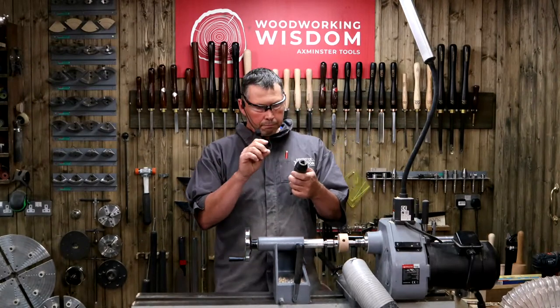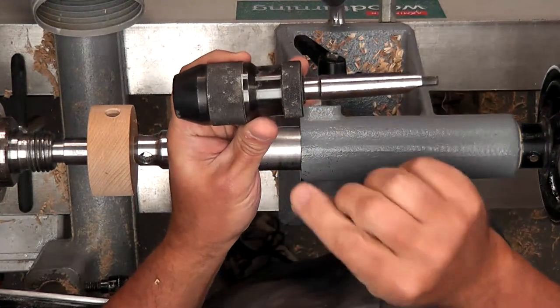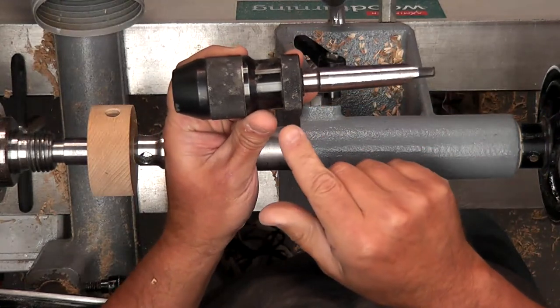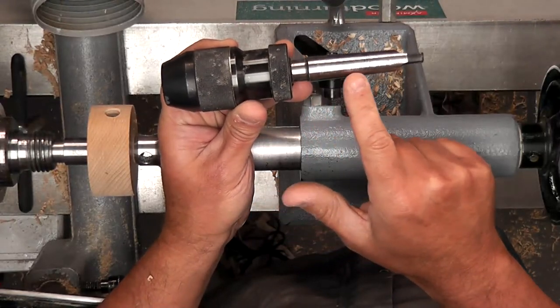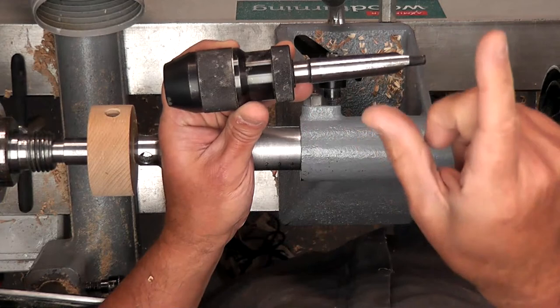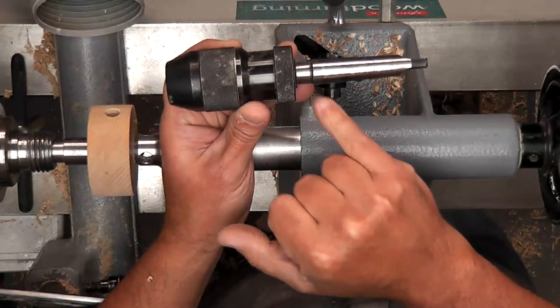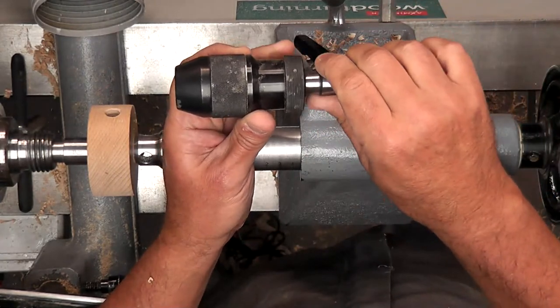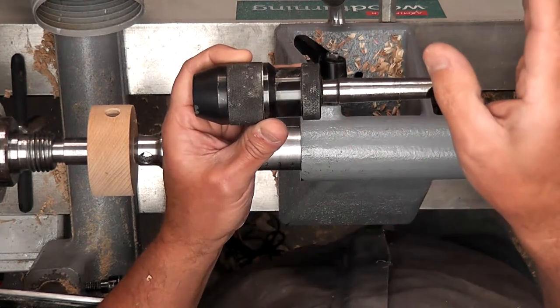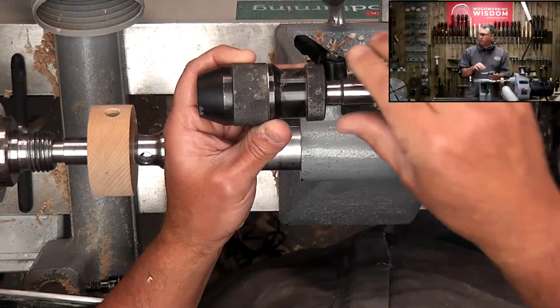You've got two choices. If you go for something like this, so this is a keyless chuck. These are the ones I tend to use all the time, purely because it means I don't lose keys in shavings, that sort of thing. So I'll use one of these on a Morse taper number 2 for my lathe, which will be what you need. Generally, these are a B16 taper this end. Now, I don't want to confuse you at all. So what I'll do, if you could email the question, I'll send you back the link, unless our guys can find the link for you now.